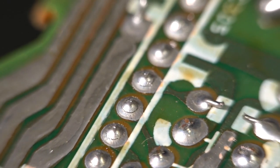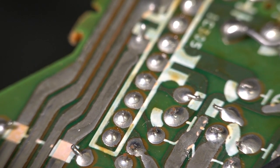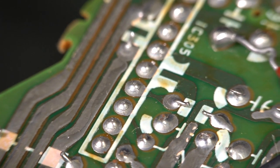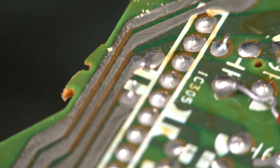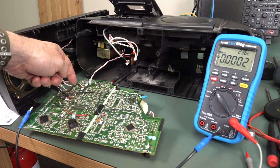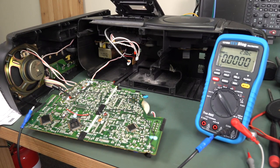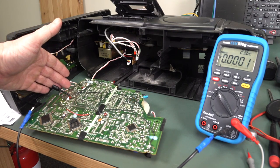Look at these joints. Dry as a dead dingo's donger. These are of course the pins for the power amplifier. They've just completely cracked thermally over the years — heating up, cooling down. That'd explain it. They've all come a gutter. That's terrible, Muriel. I could have saved myself a little bit of time if I had just done a better visual inspection of those. I should have looked at the power transistor. Of course it fits the symptoms we're seeing — it's intermittent. With joints like this it'll be horribly intermittent — it changes when you power the thing up because thermally it's different. Who knows what issues are caused by not just one but potentially more than one cracked joint. Classic failure mode.